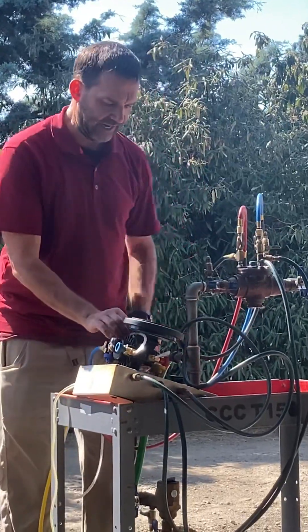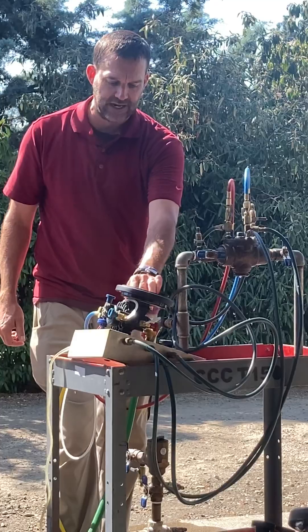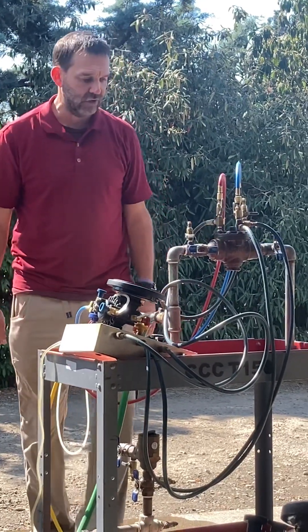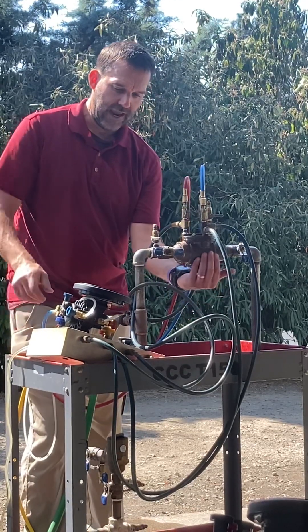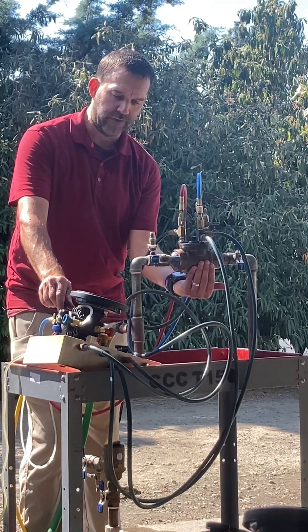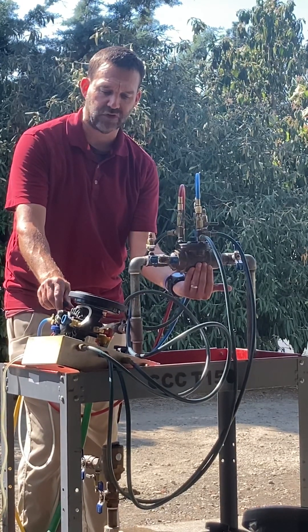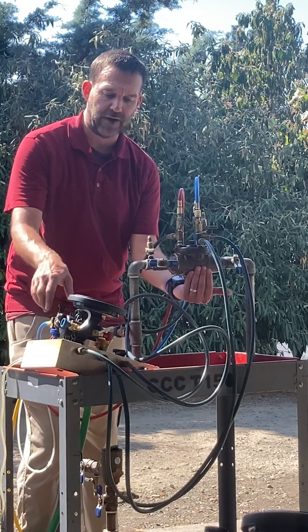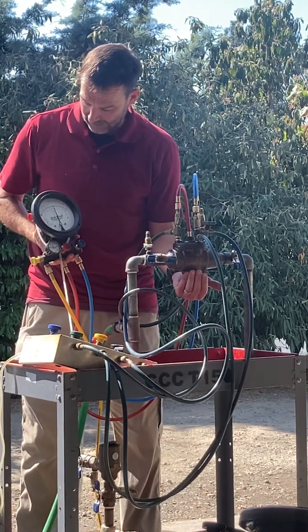From here, I'm going to test the relief valve. I move my hands down on the gauge. I open the high side needle a full turn — I never touch it again. Now I put my hand under here and crack my low no more than a quarter turn. I can always slow it down, but it falls every time. Slow and steady wins the prize.